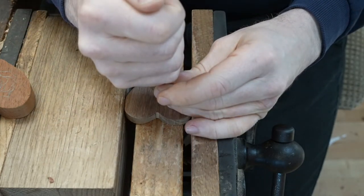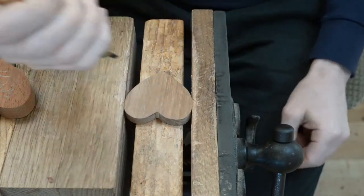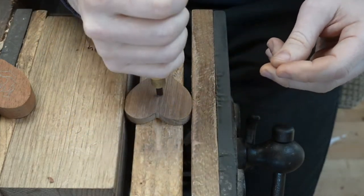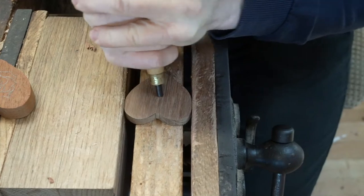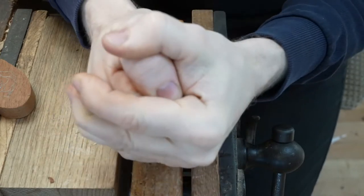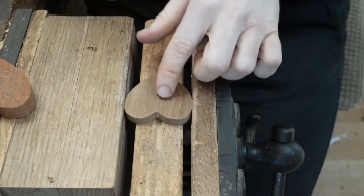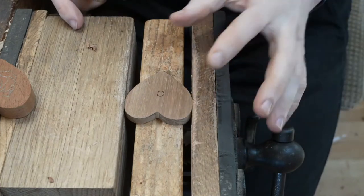What I do with this one — we start off, measure it out with the gouge, angle it right over, and then cut a stop cut. We then do the same in the opposite direction: measure out where it's going to go, angle over the gouge, and mark out a second stop cut. So that gives us our centre point to work from.